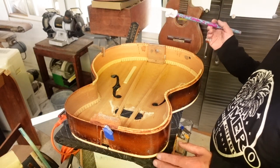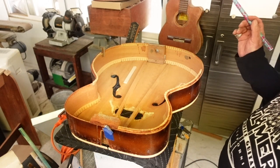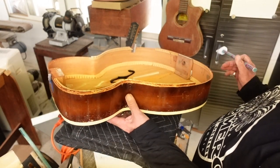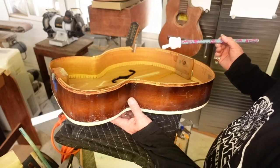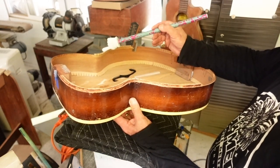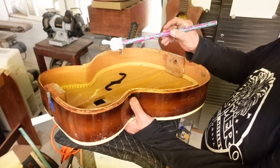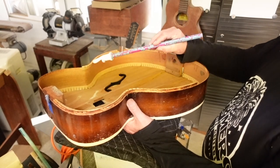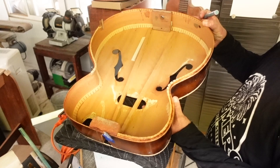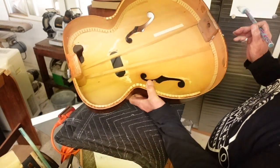Welcome back to the KK-150. When we opened this up you saw it — we have to put new kerfing in here. The trick to this is the kerfing became the binding channel. So if I just go gluing kerfing in here as we usually would, making it level with the sides, that is not going to work. What we're going to do is leave some of this original kerfing in here and use it to level everything out. If you don't, the back won't be right and the binding channel won't be right.